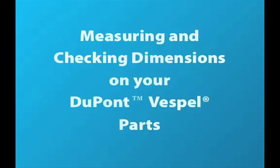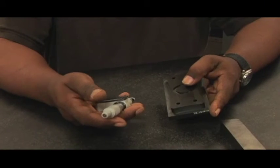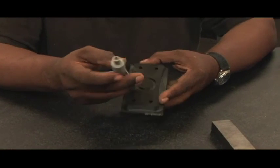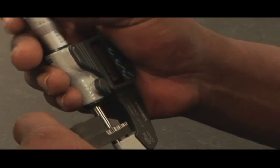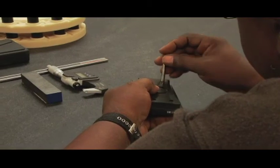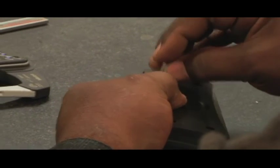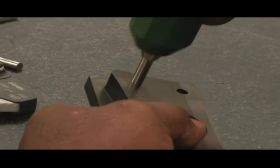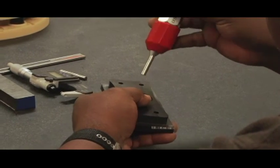In our final step, we check dimensions. If using a micrometer, don't use it in the normal fashion — this could cause the part to deform slightly and your reading won't be accurate. Instead, use it as a go and no-go gauge by setting your tolerance first, then passing the part through the gap. Set the micrometer to the upper limit and use it as a go gauge. On thin-walled parts, a correctly sized inside diameter plug may be inserted to minimize distortion. A plug gauge is preferred, but avoid forcing the plug gauge into the hole. Another option for inside diameters is an air gauge.